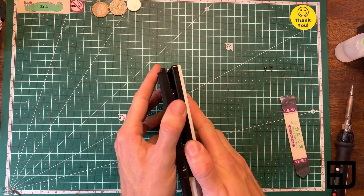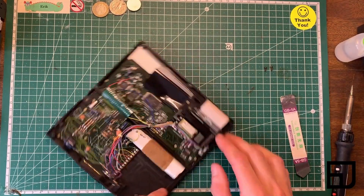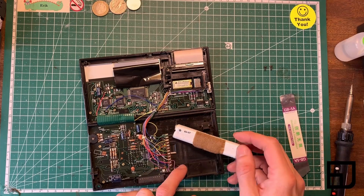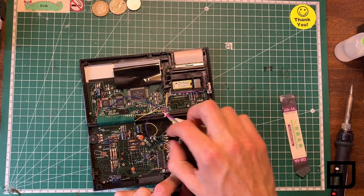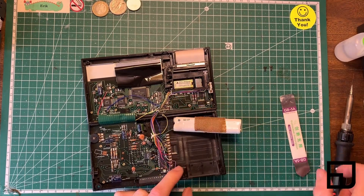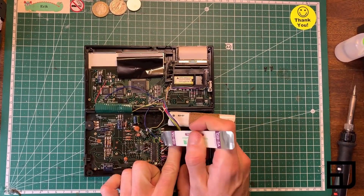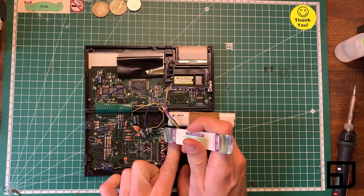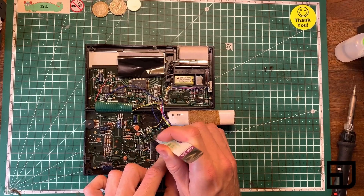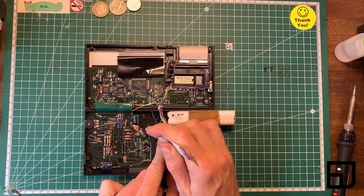There we go — there's our battery pack and it is completely disconnected. There's corrosion; they look like triple-A size. The positive lead has broken. You can see there's some NiCad residue here, some nickel corrosion that has eaten the trace — that trace has completely dissolved.